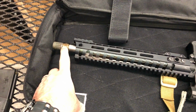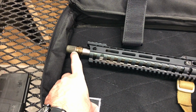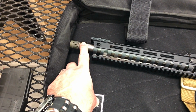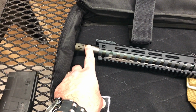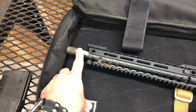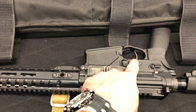All right, continuation on the video. I tested it without the muzzle brake. Y'all saw that. And it still went into single action, so to say, and was causing stovepipes. Now we've got this back on with Rock Set, but I'm not going to screw a suppressor on there, so we're good. So that's back on. So we've taken that out of the mix as causing the problem.